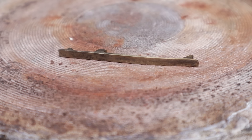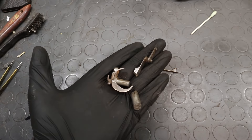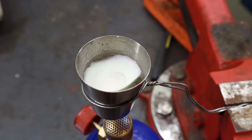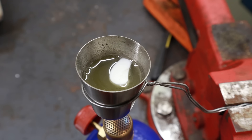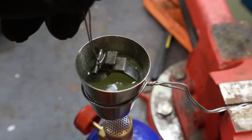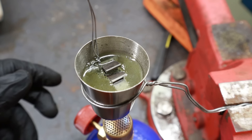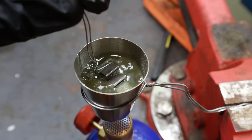For a simple small part like a leaf spring, resting on a hot plate is good enough, but on larger, more intricate parts, you'll never be able to get a uniform temperature, so the colour won't be uniform either. One way around this is to use a bath of molten nitrate salts that act not only as the heating medium but also as the source of oxygen. In this case I'm using a 50-50 mix of potassium nitrate and sodium nitrite. The exact mixture doesn't matter as long as it's molten at the temperature you need, but the presence of nitrite, although poisonous, renders the process quicker and more reliable.